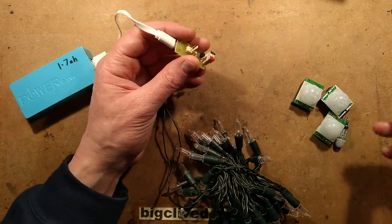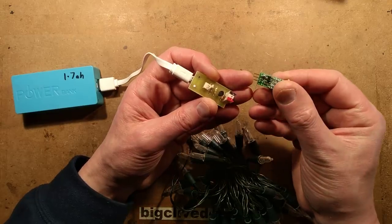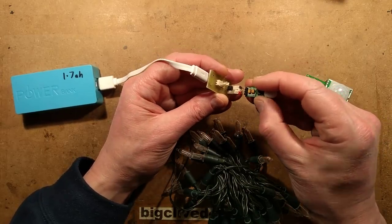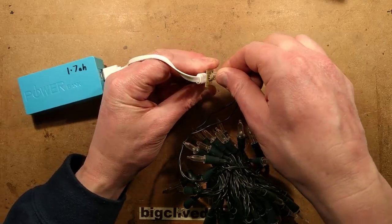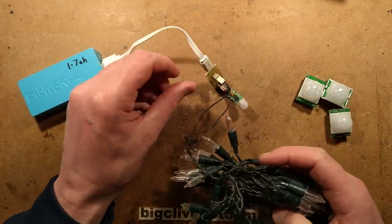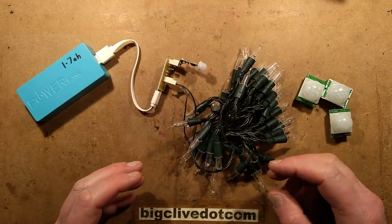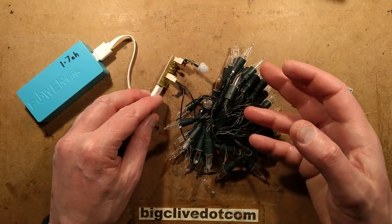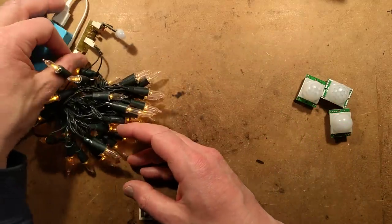You can choose a passive infrared module — for instance these little ones here — make sure you get the polarity right. It plugs into this connector, and then you can plug the string of LEDs into this connector and it will power them. This one has a built-in timer function, so it will be a while before it stabilizes and then the lights will kick on.